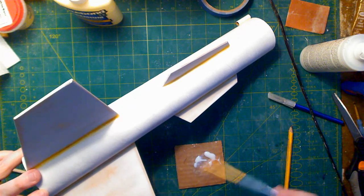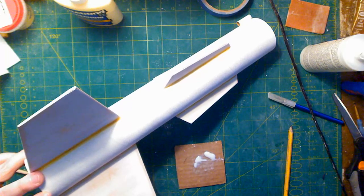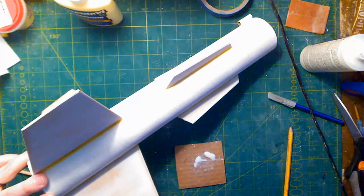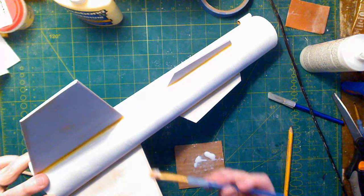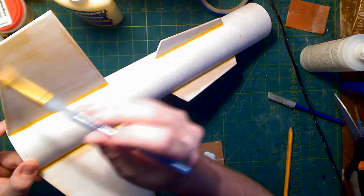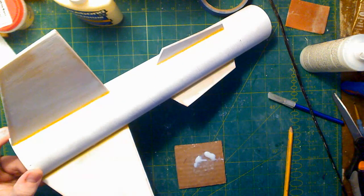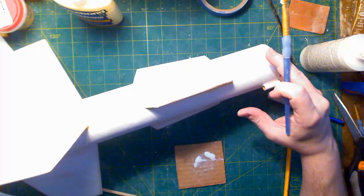And again, it's a liquid, so you should probably just follow best practice and paint one face and then immediately flip it over and do the opposite face, just in case. It's very unlikely that this big, thick piece of plywood's going to warp, but better safe than sorry. And like, there was a big glob that came over the side when I just painted that one, so do check for that. It's not the world's worst idea to brush the top as well. That's not a terrible idea.